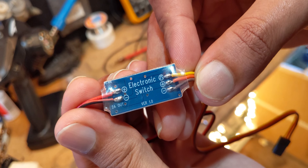For the trigger I was planning to use one of these electronic switches, but it had some continuity on the other end so it didn't work with the thyristor. So I used the third channel which only toggles, glued a switch to the servo, and made a servo switch. The right one is for the trigger and the left one is for charging the capacitors. At about 90% done, the thyristor started misbehaving — it began shooting by itself after charging for a while without using the trigger. I tried flipping connections but then it showed continuity on the multimeter, meaning it died. I ordered a new one, wired it the same way, and this time it worked perfectly.